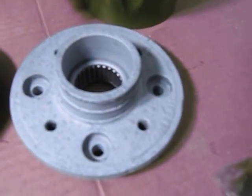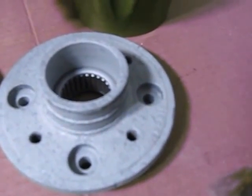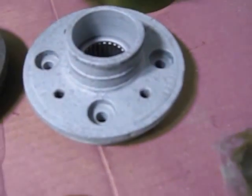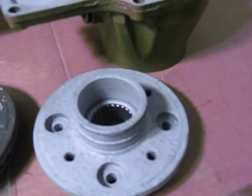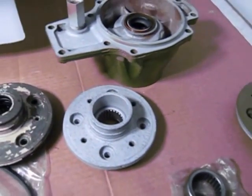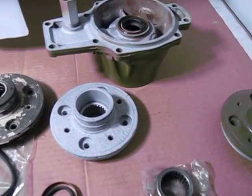The 680 Loctite will allow up to 20 thou gap — so if your unit almost falls through, don't worry about it. Prime it with 680 Loctite, leave it 24 hours, put the Loctite on the outside edge and on the inside, leave it another 24 hours, and then one more coat just before you put it together. That's pretty much it for this portion of the video.